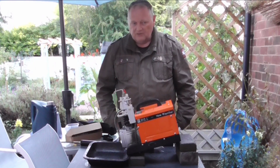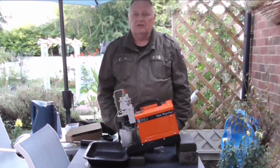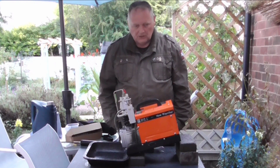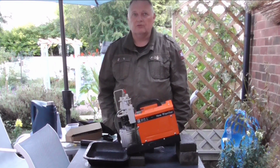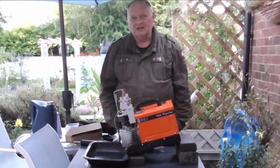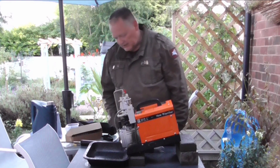Like in 10 minutes it will fill 2-3 litre air tanks from 200 bar up to 280 bar, and that keeps me going for a long time anyway, so that's why it's only had less than 2 hours of use. In the first month they recommend you change the oil in either a month or the first 25 hours. Then after that it's every 3 months or every 50 hours. So I've only had to change the oil basically based on time. I've gone just a bit over now, we're into July, so this is my second oil change now.